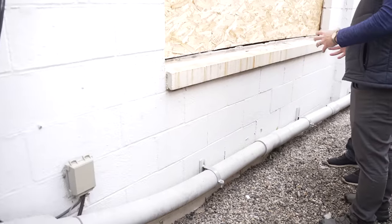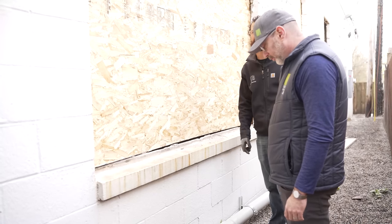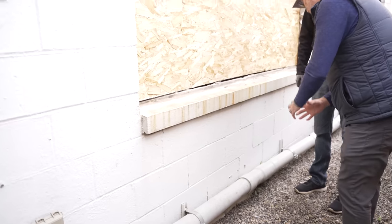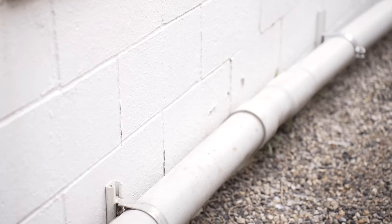It was pulled apart. I wonder if he tapped that coupling over. Yeah, that's what I'm saying. I think Matt tapped that coupling over. See, it kind of looks like it had moved, but it was apart. So maybe they already messed it up. Gotcha. This PVC run doesn't have any expansion joints and it's pretty long, so that's prone to happen. It might be just a matter of getting it back centered, not to say it couldn't pull apart again, depending on where the tension is. Especially when it gets cold is when it shrinks, right?